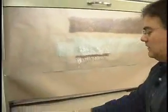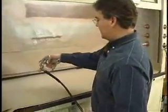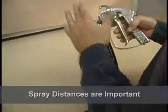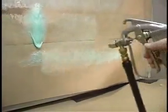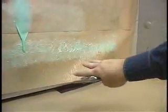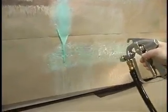There are a couple other things I'd like to talk about with regard to these products to help you give a good value sell. Spray distances are very important for the lace spray particularly. Just like in the aerosol can training, it comes up in a pattern like a football and then collapses. Where we would want to be spraying is right when that initial piece happens — about four inches from the nozzle. That's going to give us a nice clean edge. If we get further away, it's very inefficient — we're going to be wasting a lot of glue and we've got a lot of hollow spots. We want one pass to have about 80 to 85 to 90 percent adhesive coverage. If we need a heavier coat, we want to get there in multiple passes.